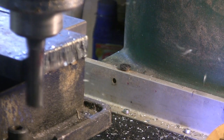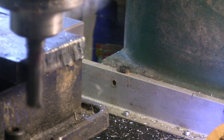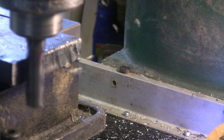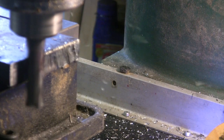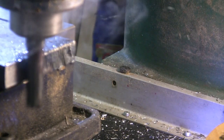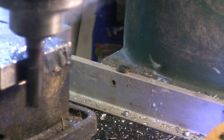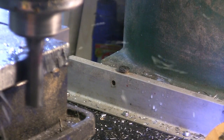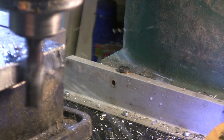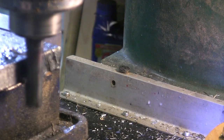I'm going to peel this end off, and then I'm going to go over the bandsaw and cut 4-inch pieces out of this. So they'll be 4x4 pieces. This is really not good for carbide either, because carbide likes to be either coolant or no coolant. It doesn't like getting hot and then being cooled. Seems to be cutting it okay.